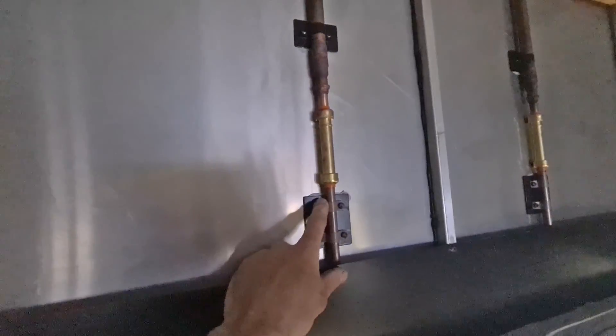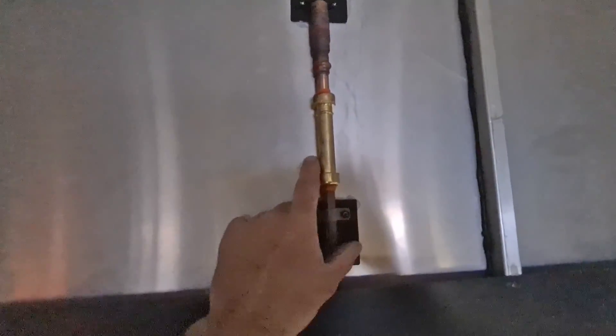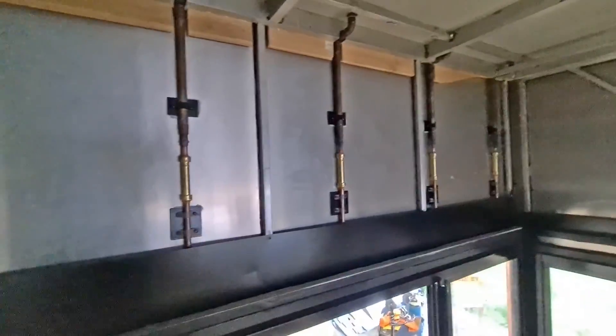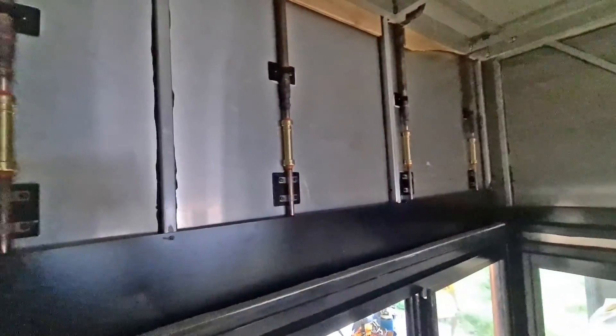Because this wall frame is only 20mm I could only put quarter inch tube running through the actual wall frame itself, so it goes from 20mm to allow as much water as possible down and then comes down to quarter inch. There's a slip coupling on every downpipe so it's possible to take that pipe out from underneath if you have any issues. I know this is pretty small diameter tube so there's a good chance it'll block up, but it is possible to disassemble it and clean it out. I also put a screw-on cap on the end of the pipe over there, so you can unscrew that and if you need to, put a pressure hose down the end and blow it out.